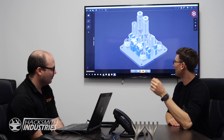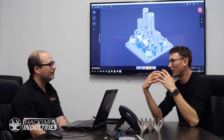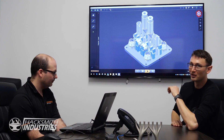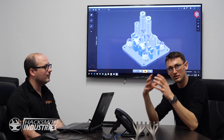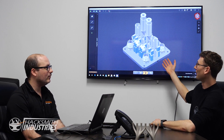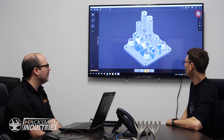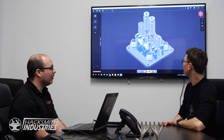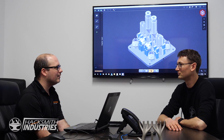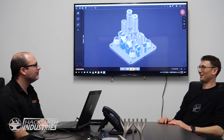The reason I chose metal 3D printing was I had a lot of complicated geometry that I wanted to achieve and I'm not capable of machining that. It seems like a perfect application to utilize metal 3D printing. I also wanted to reduce the number of components — it's easier to design it, throw it on a 3D printer, and have it show up without the joints you'd necessarily have with machining. It's a great example for legacy prototypes where parts need to be complex and in materials not typically easy to machine, like titanium.